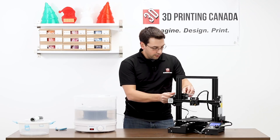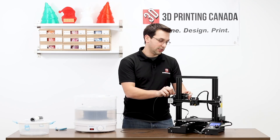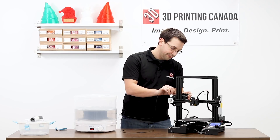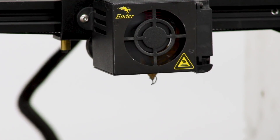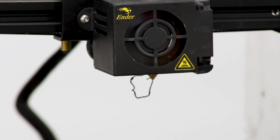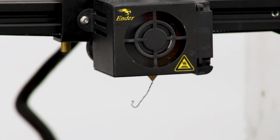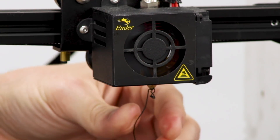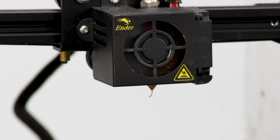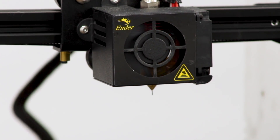So here's my dry filament. We'll pull the wet one all the way out — we're done with it. The little bit of white on the filament was just the previous color that I didn't fully bleed out. No hissing or popping, so that's a step in the right direction. It's a lot more smooth than the wet one was, and hopefully the real proof will be that the layer adhesion issues I had previously are gone.